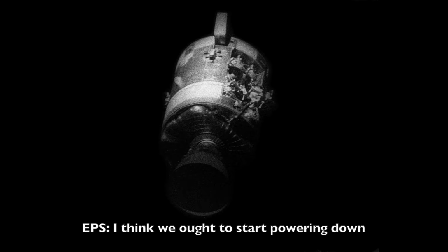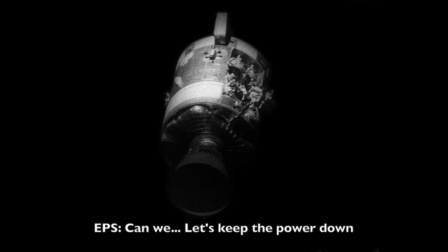I think we ought to start powering down. Yeah. Main B bus is offline, fuel cells 1 and 3 also off the line. Fuel cell 2 is presently on the line. EECOM, do you want to go through that again? What do you want to power down to? I want to power down a total of 10 amps, Flight. A total of 10 amps. That's firm.